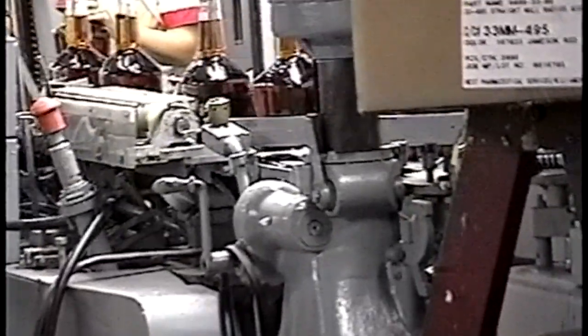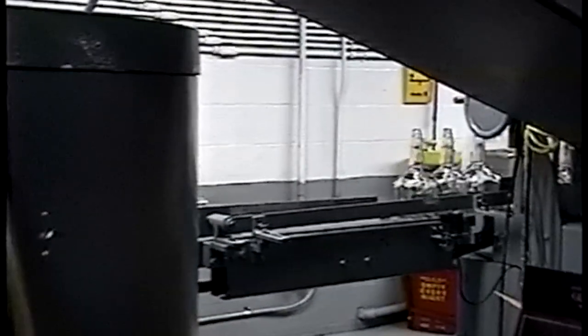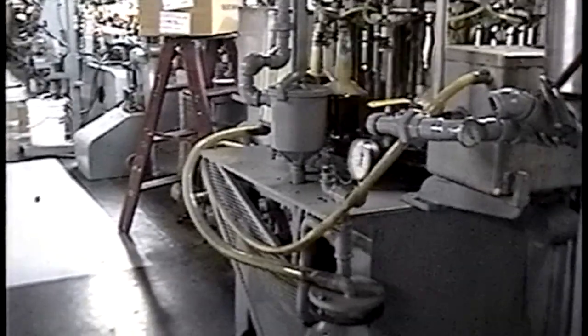At the beginning here, it's going to flip the bottle over, and the bottle will go down and sit right side up. Then our empty bottle is put on the belt above. At the end, we're going to put the finished product back inside the box that it came out of. The bottles go through a cleaning process down there. Tubes go down inside the bottle, and the bottle is aired out to get rid of particles. We don't waste this product at any time. After it's been filled,